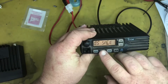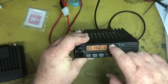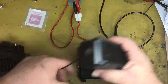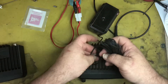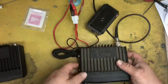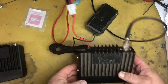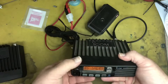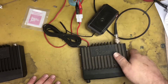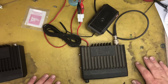We've got a signal here, but we've got no sound. Get an external speaker and plug it into the jack. It looks like we have a fault with the internal speaker — it's probably got a crook coil connection, or the jack that goes onto the circuit board has come off. Let's open it up and find out if we can fix it.